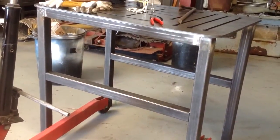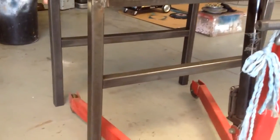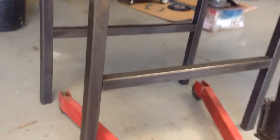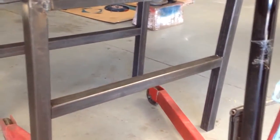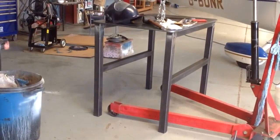The tubes at the ends of the box sections were cut nice and square. What that means is it's very easy to just wedge some more box sections — same length as the top ones. I've got a box section along the top here and a piece the same length in here. I just hammered it in, bumped it level and tacked it, and I'm going to do the same on the ends. It looks like it's going to square up nicely. It's standing level on the floor, all the legs touching the ground — which is quite a good sign.